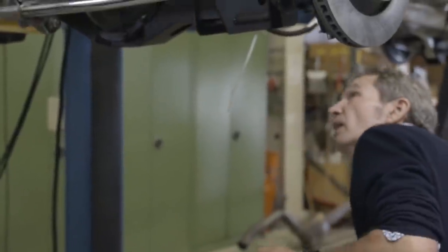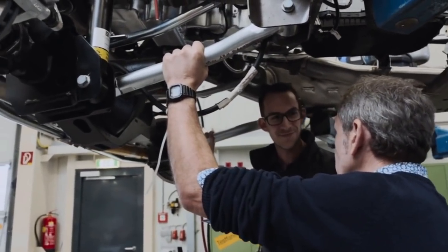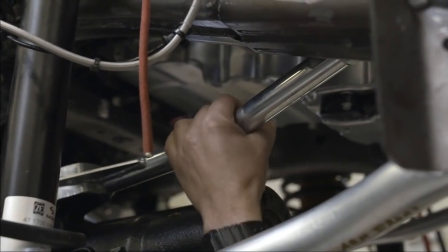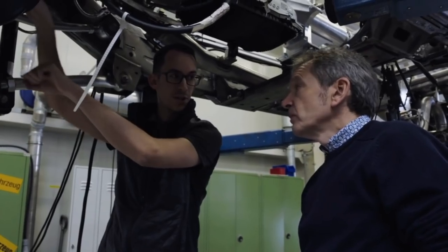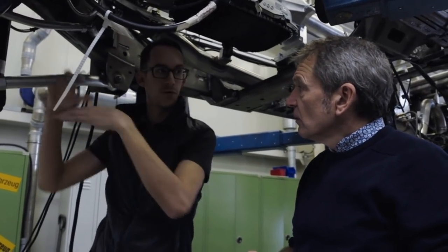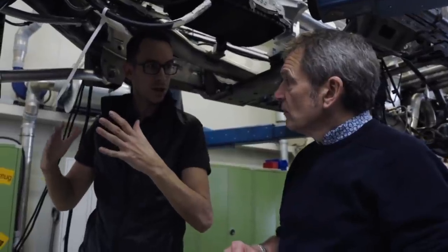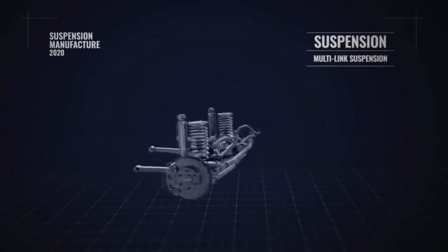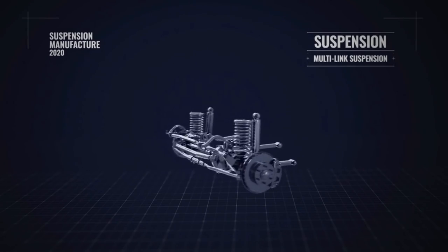So, underneath, two really hefty big bottom links and then two slightly smaller top links. That's right. This gives the stability against the rotation in this direction for brake torque and so on, and also good stability during the driving. These four really strong links help stop the whole axle twisting or moving forwards and backwards.